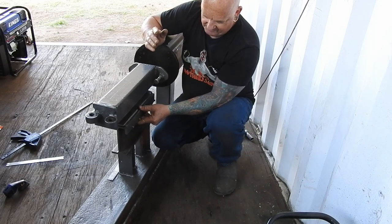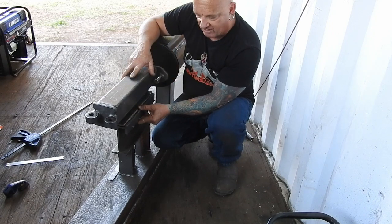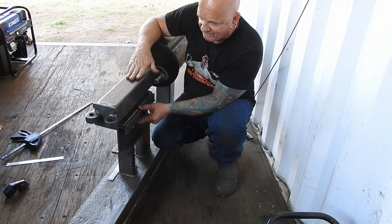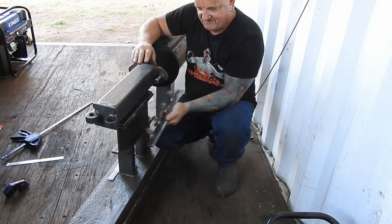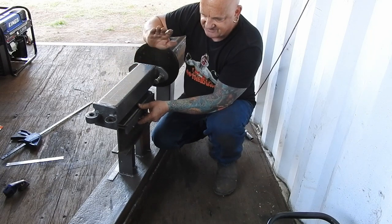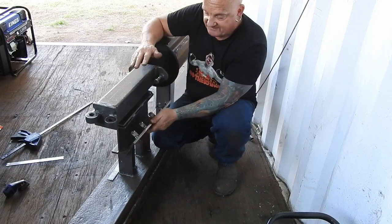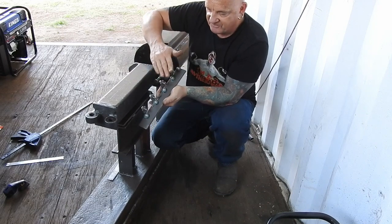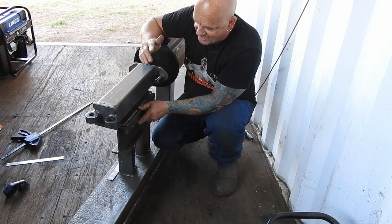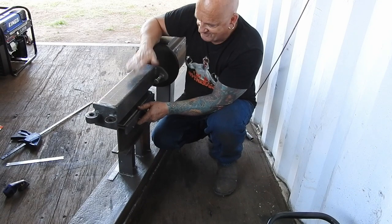No friction because of the bearings, and I'll fit this all up and just weld it to the actual hammer, so it's a lovely tight snug fit. It's a shame about the longboard wheels because I really liked them, but I'm much more confident with this one. This on both sides will keep the hammer nice and secure with minimal movement — hardly any — because I actually welded all this in situ, so I know this fits snug. I just couldn't risk it, so I'd much prefer this.